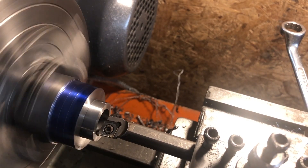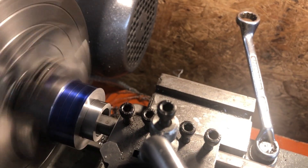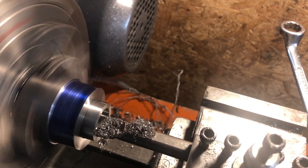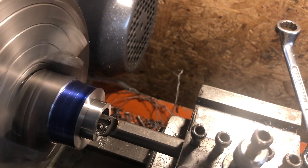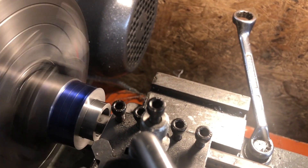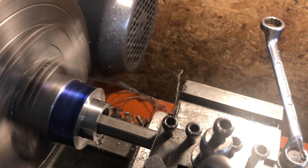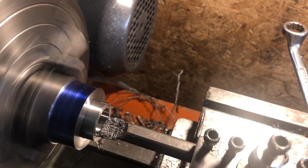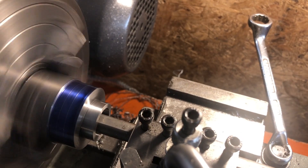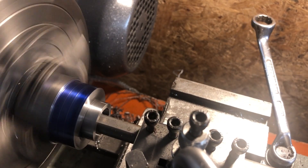A quick sanity check of concentricities ensures the part hasn't shifted in the chuck, then on to the boring. I'm feeding towards the headstock under power, and after the first couple of passes I do the same on the return without adding any cut. My lathe puts on a repeatable thou or two all by itself when backing out, and it's easier to let it and take measurements using a telescoping gauge from there. Although I will be using less than half of the material in the chuck, I am boring all the way through. This is potentially wasteful in material but it really aids swarf egress and saves having to bore a blind hole. I very rarely make use of short sections anyway as there tends to be no good way to hold them — although I will still keep this, just in case.